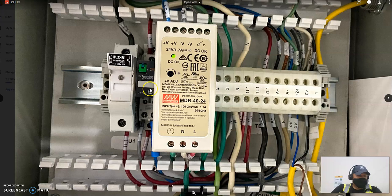So the relay is energized and I know I'm not getting voltage on the other side of it. The way this relay works is it's normally closed, so normally the circuit stays closed and lets the 120 flow through. But when it gets the signal from lines 24 and 1 and the 24 volts flows through it, it opens the relay and we lose power.